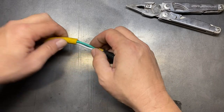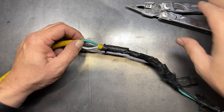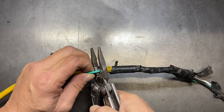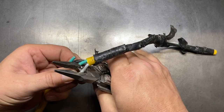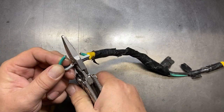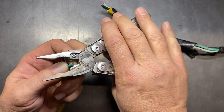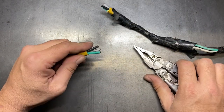We're going to do the rest of this with just the Leatherman. That's how I normally get the jacket off when I have to do this kind of in-the-field work when I don't have all my tools with me. Get enough where I can get to the wires and then get them cut off — we'll try to get all these cut off evenly. Might have to redo it just a little bit. Yeah, I got that ground wire a little long.